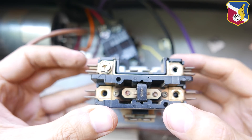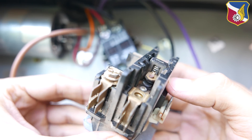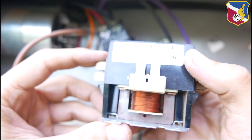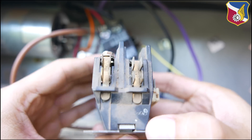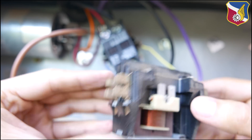This is a single pole — earlier you saw the double pole. Since we took it out, you can see how it's all burnt out and damaged. It's best to replace it now rather than later. The 24-volt AC goes to a coil that creates a magnetic field and then pulls that contact down — that's how it works. So that's how you replace a contactor. Good luck replacing yours.